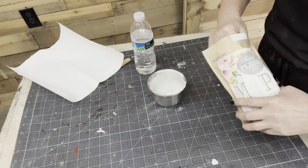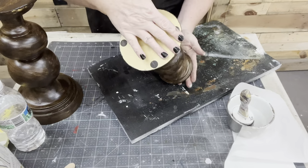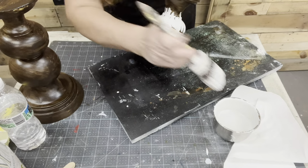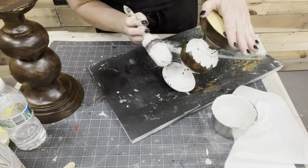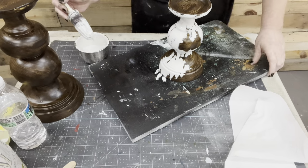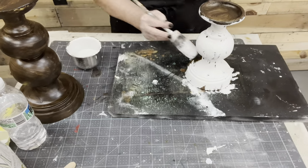All the product items I'm making over today are going to be getting milk paint. I really like this milk paint, and I can see using it more and more. But I do feel like it's a one coat kind of thing. Since you have your paint effect on there, you really need to get this next coat on in one go, because it's going to crackle. So you're not going to reapply after it dries the second coat. The milk paint is a little bit thicker. Dabbing it on is getting it on there. Like I said, the crackle effect itself is sticky, so it's attracting the paint. As you see, I'm not really doing a brush stroke, I'm just dabbing the paint on there. And of course I flipped it upside down first so I could get that bottom area, so I can get this all covered up in one coat.